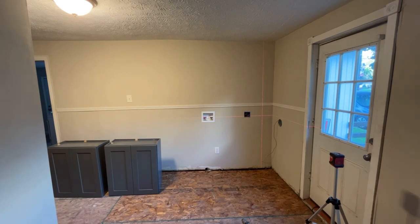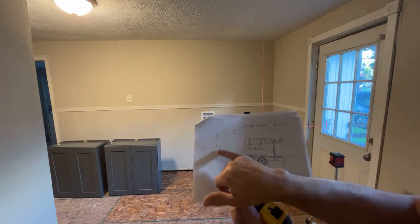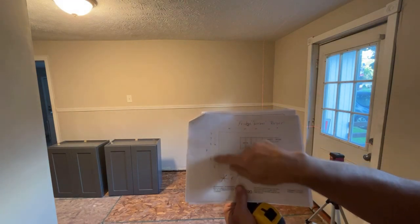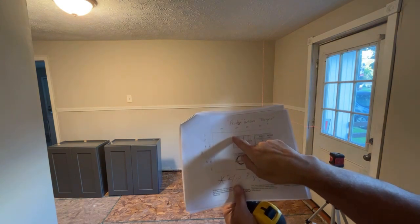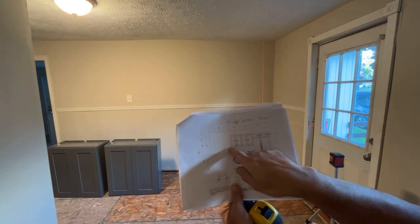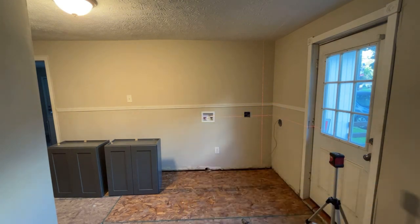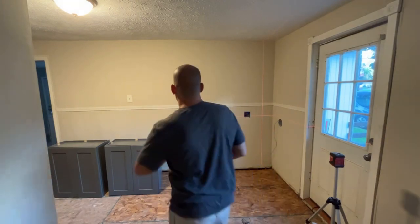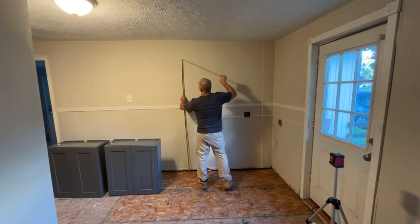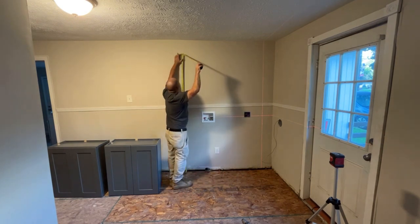On the prints here, the total height of the cabinets is 54 plus 18 plus 12. So that's 54 plus 30, which is 84 inches to the top of the cabinet. So I gotta measure up 84 inches and then I gotta come down 30. 30 will be my baseline where the cabinets are gonna sit. So let me just get a ballpark idea here. If I go up to 84, which is right about here,